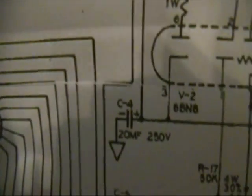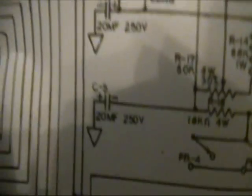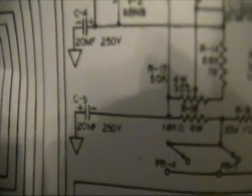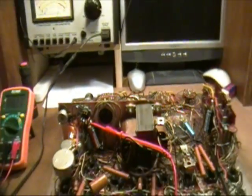The positive voltage right there is what's used for the plate of the tube you're testing, and the negative voltage is used for the bias value, and then it's tapped down through some resistors and so on that we can talk about a little later. So let's see if we can find out why it's not putting out 148 or 49 volts. Well, I discovered what my problem was.